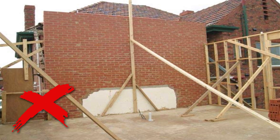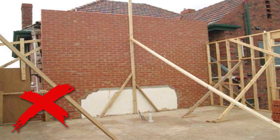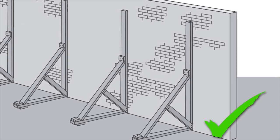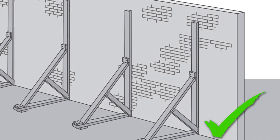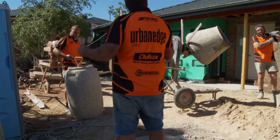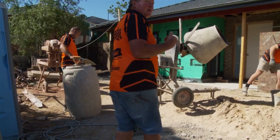Provide adequate temporary bracing while the structure is unstable, especially if the lateral support from piers, cross walls, floors and roof framework is not yet in place or being altered. By remembering each of these and following these basic steps when bricklaying, we can help keep each other safe.